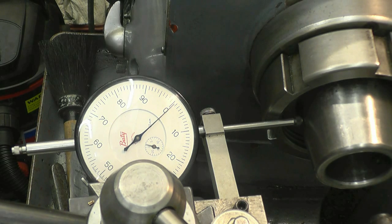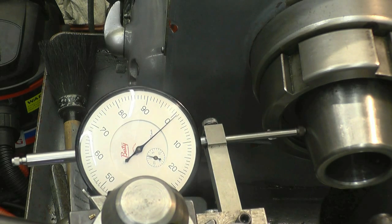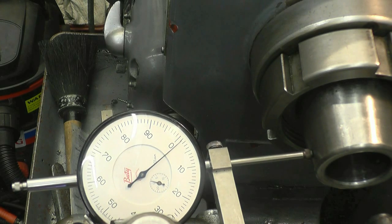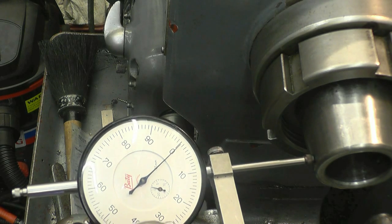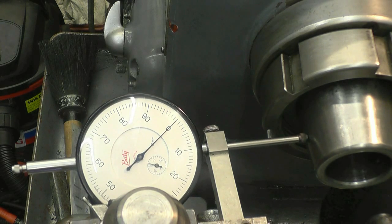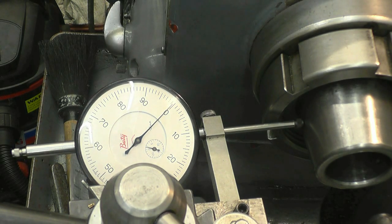Clock gauge on zero. I'm going to wind it back under power using the adapter on the drill. As you can see, that's less than a hundredth of a mill. I'll take it back in again. Okay, so that's actually less than a fanny's hair — a lot less. I'll nip the collet and try it once more.